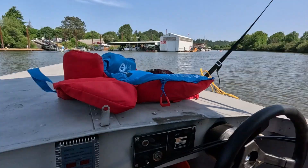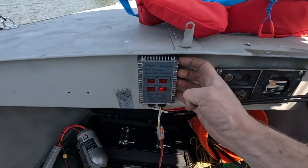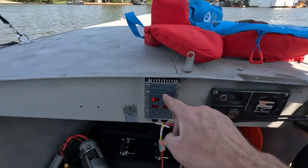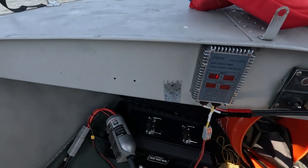I think I have room for one more solar panel, and I might want to add another charge controller so I could have two panels on each one. That would be 360 watts going into each controller. I have an XT60 splitter that would go into the battery's charge port, so I could have two controllers feeding the battery simultaneously.